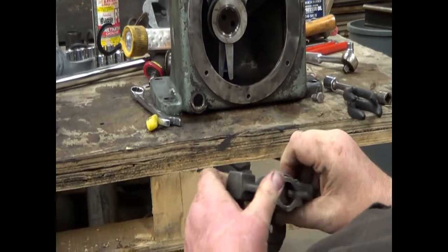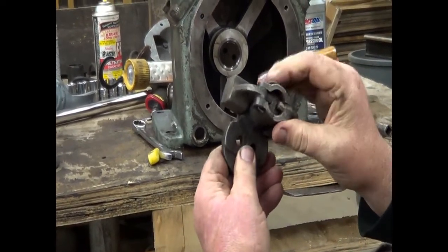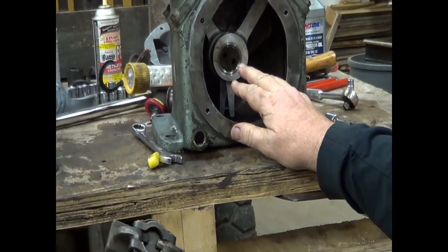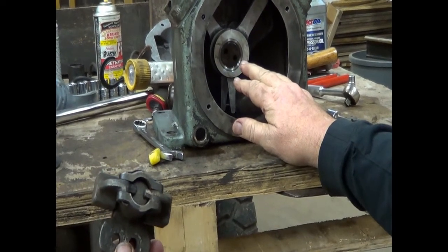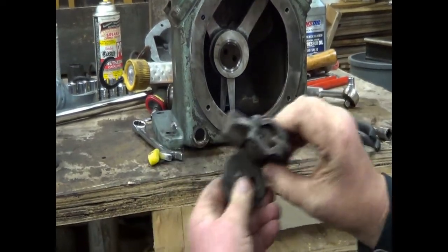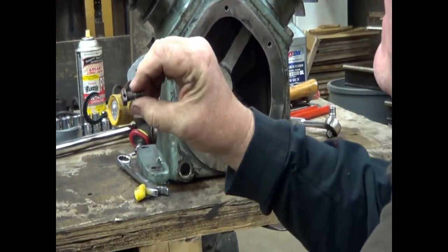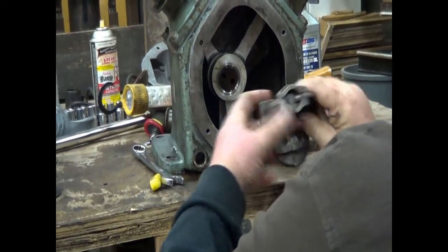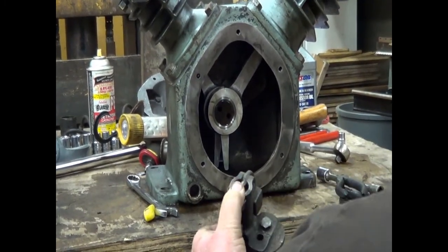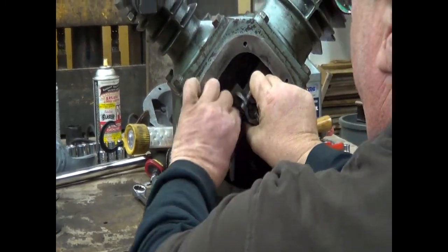This is our counterweight. We're putting this back on only as a bearing keeper and to help keep the machine balanced. We're going to eliminate the centrifugal unloader. However, this still has to be installed correctly to hold the bearing and for balance. So, we have our two bolts that have the holes drilled in them. We go through our two holes, and we're taking away Val's smiley face.